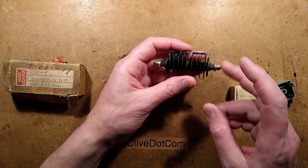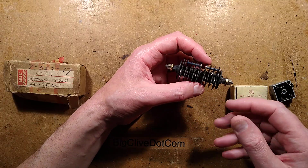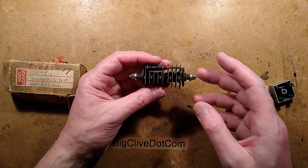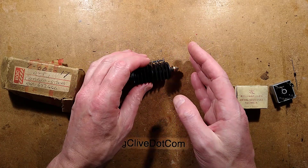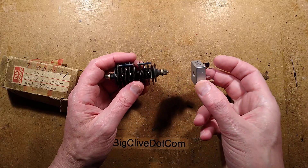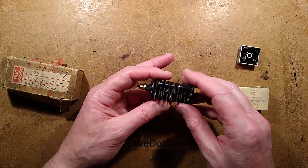Let's talk about a really interesting vintage component called the selenium rectifier. Anybody who has worked in really old factory equipment, elevators, or entertainment equipment like bowling pin setters will have come across these things next to the transformer, with loads of square metal fins just stacked end to end. These are selenium rectifiers — they predated silicon rectifiers, but once the silicon ones came in, they replaced these completely for reasons that will become obvious as we explore it.